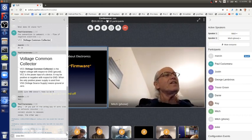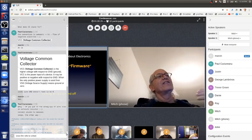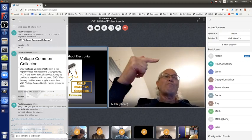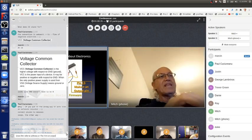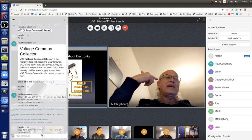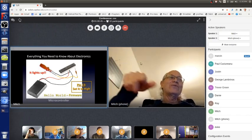All right. So what about our firmware? Well, I already told you what it is. It's a very, very short program. The first line is, yo, microcontroller, pin 13 is now an output pin. That's the one our LED's connected to. And then the next line is, yo, microcontroller, make that output pin high. Now there's voltage there.